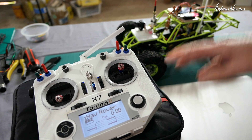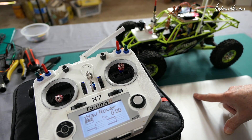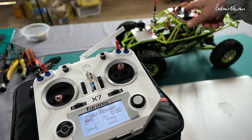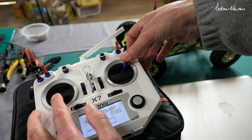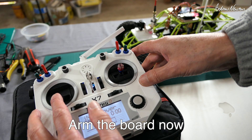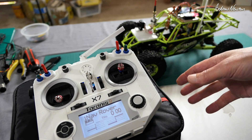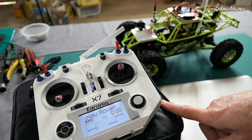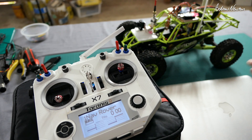To activate a waypoint mission: first create the mission in mission planner, then load it onto the flight control board, then load it to the EEPROM using your stick commands, then flick it into waypoint mission mode and it'll take off by itself and complete the mission. What it does at the end of the mission I'm not absolutely sure yet — mine was slowly circling around the home point. Possibly if I select 'land' at the end of the mission when creating it, it might come back and stop, but I'll check that on my next rover expedition.